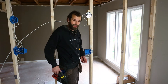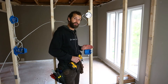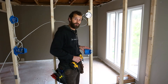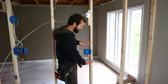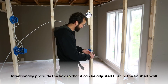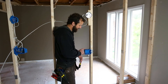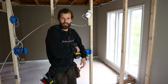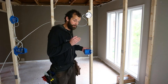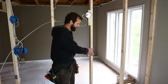That's key, because in this bathroom the finish has not been selected. If this wall ends up being durock and tile, it will be a different thickness than half-inch drywall. So I'm going to intentionally back this box out of the wall such that whatever finished surface comes up to it, my box is protruding intentionally. Then at the finish out, I can adjust the screw to match exactly the face of the finish surface. This box will cost about two dollars above and beyond a standard two-gang nail-on box — it's more expensive, but it helps me execute at a higher level and meet code requirements.